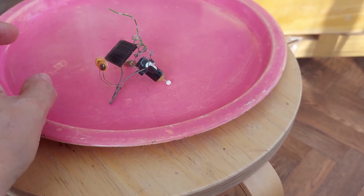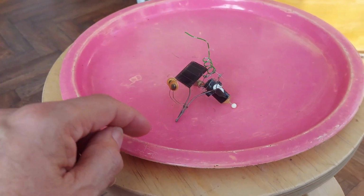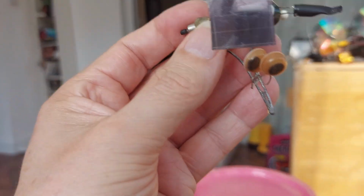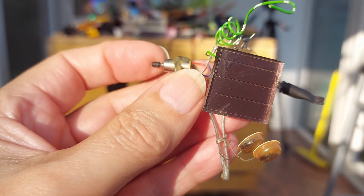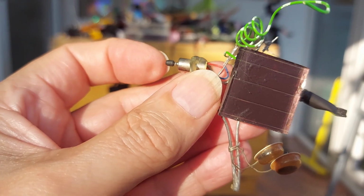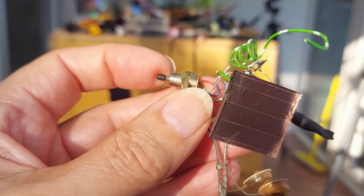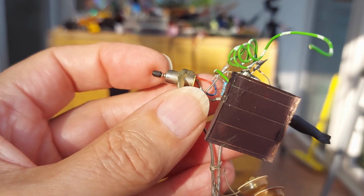And I put it out this afternoon because we had a beautiful sunny day. There's still some sun out there, but it's a bit too late now. And it wasn't working. Right, if I held it up in the sun and moved the motor's armature by hand or by finger, I can feel it. So I think what's happened there is the brushes have died, and you have to sort of maneuver it around a little bit for the brushes to actually make contact and make it move.